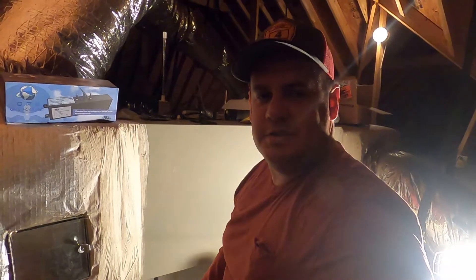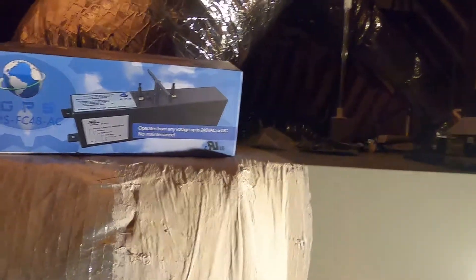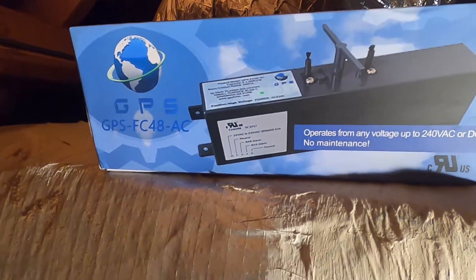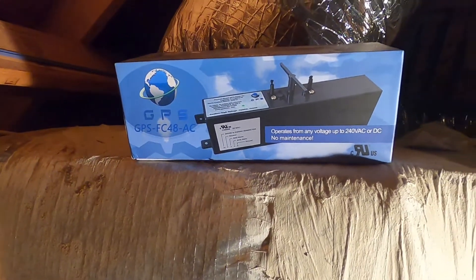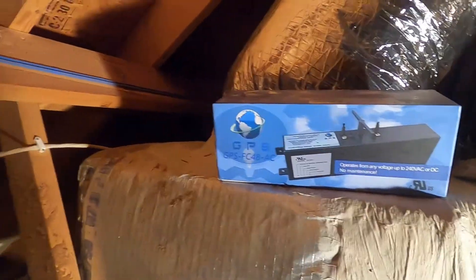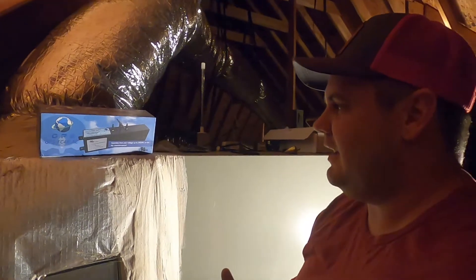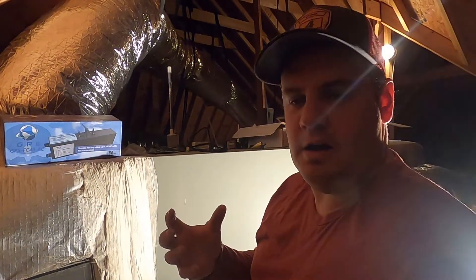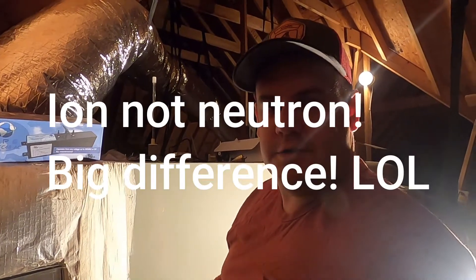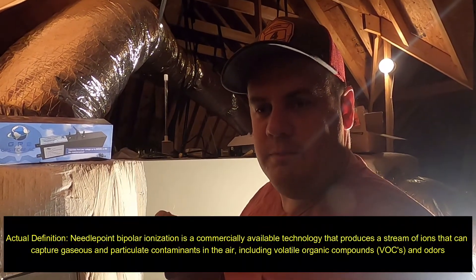This is something I've been wanting to do for a couple years now and wasn't really sure on the research. I wanted to make sure what I was doing was the right thing for the house. So with that being said, I finally got a GPS unit. Now, this is not a GPS location finder — this is a Global Plasma Solutions system. This is a needle point bipolar ionization system. These two points energize the air with positive and negative ions, which makes particulates in the air clump up into bigger clumps, helping your return air filters collect more dust and more particles.